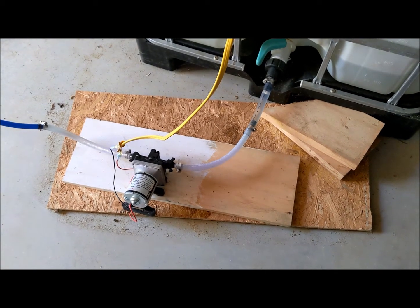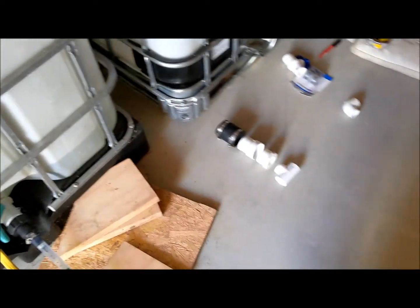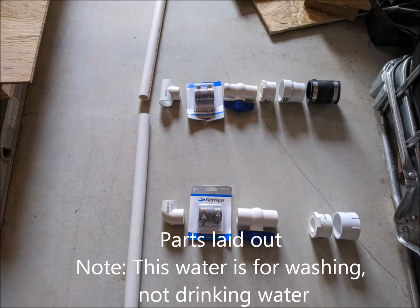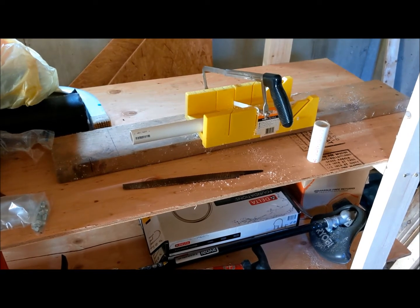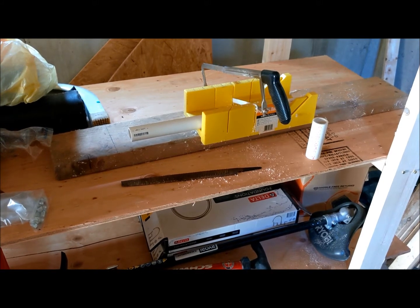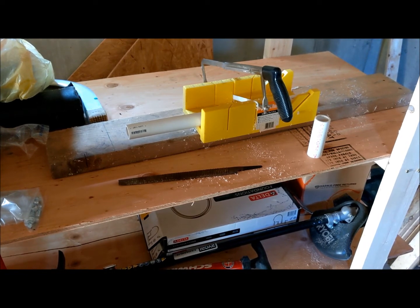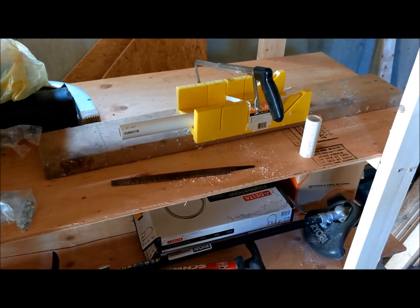I laid out how the pieces will go roughly on the floor, so they're going to look like this. This is my pipe cutting station — it's an old miter box. I put the pipe in there, cut it with a hacksaw, and it gives me a straight cut. Then I use the file on the left to file the edges down smooth and get rid of any cuttings. The finished product is that section of pipe on the right.